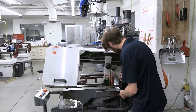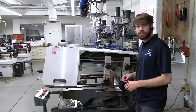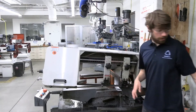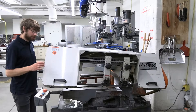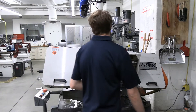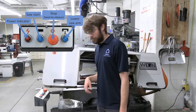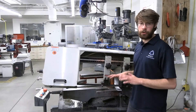Using a small ruler or scale, I'm going to line it up with the blade and see exactly where that blade is going to be cutting. You don't have to be super precise because we gave ourselves about an eighth of an inch of wiggle room, but you should get it as close as you can. Once you have it in the right spot, go back around and really get it tight — you want it pretty darn tight so the piece of metal doesn't get lifted up or pulled by the blade. We can start by pulling the e-stop button by twisting it and getting the machine turned on. Once the machine is on, you should always be aware that the blade will be spinning and you want to keep your hands at least four inches away from any moving part.